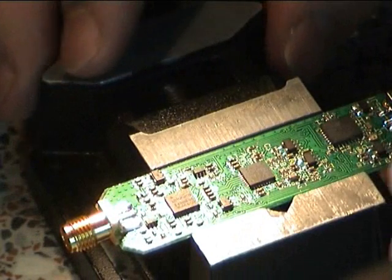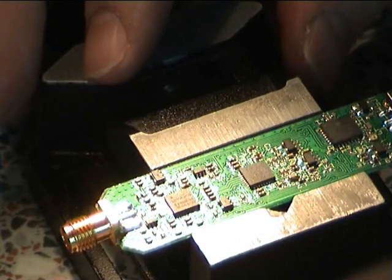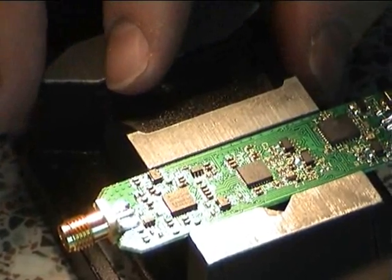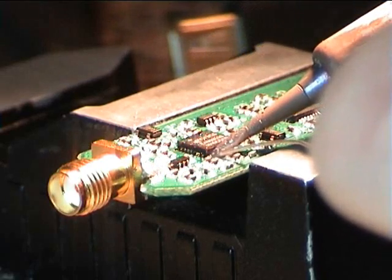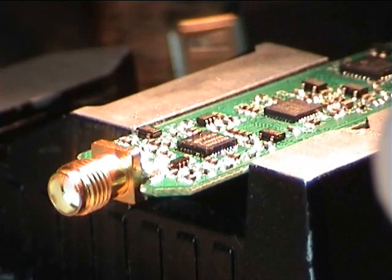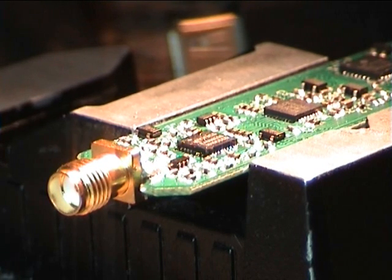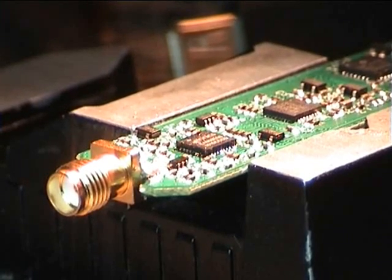The next thing to do is clean this up a little bit. I'm going to manoeuvre around the camera so you can see what I'm doing — I just want to get the solder really onto those pins. I'm going to show you how you do one side: you drag the iron along and even though the pads aren't actually wrapped around the chip, that's how you get the connection through. You do that on all four sides, and that's it. You may want to clean it up with a little bit of flux cleaner afterwards.